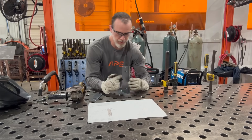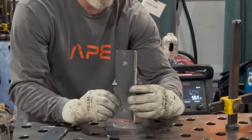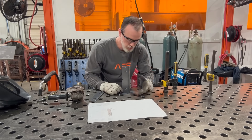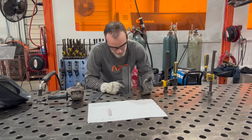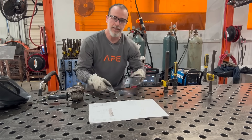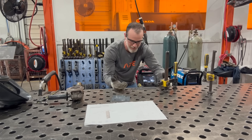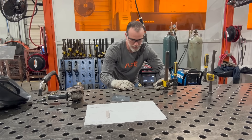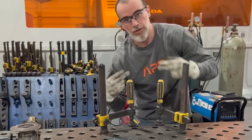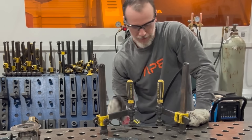I'm double-checking using the marks I made: arrows pointing up, item numbers matching on the correct side of the layout lines. This is a real easy way to double-check in-process that everything is square - all 90 degrees. If my item threes match, my arrows are all going up, and my alignment marks line up, I'm good. I got a little crossed up at one point because I didn't see my arrows, so I stopped, went back, double-checked, and now all my arrows are going the right way.